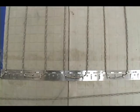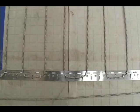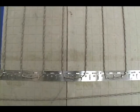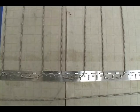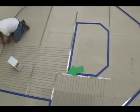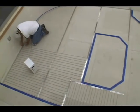You can get two-and-a-half-inch spacing by counting two and a half tabs on the strap. Don't ever space your wires closer than two inches, which causes overheating. Fill in the first section with wire. In this area, we'll add small sections of strap to fill a gap with warmth.